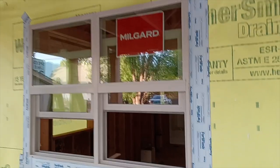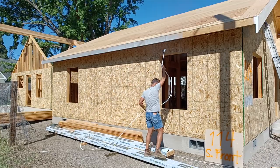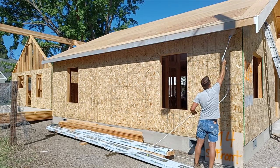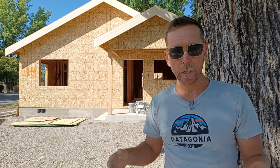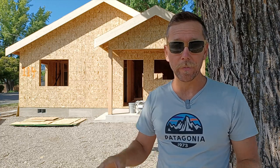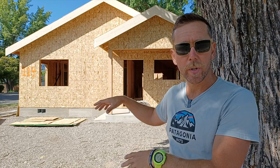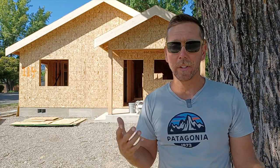We're exactly 33 days into the project and we have the front ADU completely framed up. Next I'm going to be priming and painting the underside of the eaves and the fascia. Once we're framed we really want to rush to get our roof on, or at least dried in with roofing felt paper to keep the building dry. To stay on schedule and complete this build fast we really have to keep the interior dry — if we get rain this week and all the interior components get wet, I'm going to have to let them dry for another week or two before we can insulate.